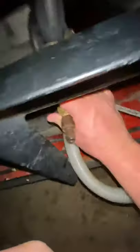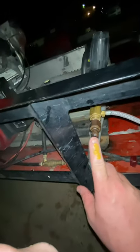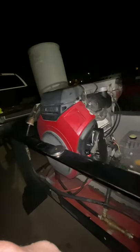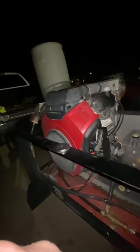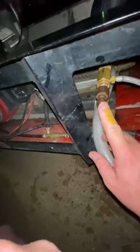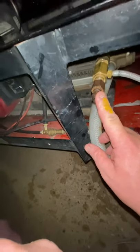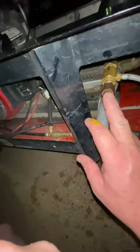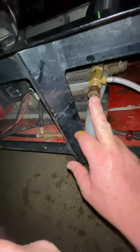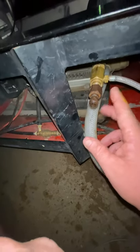So that's the downstream injector and how we apply bleach via downstream injection. Even using 12.5% sodium hypochlorite — twice as strong as Walmart bleach — we still often have to apply it two or three times, sometimes even four. Whatever it takes to not have to climb up there with a ladder and a scrub brush.